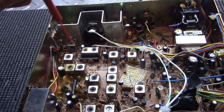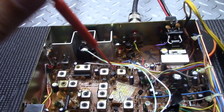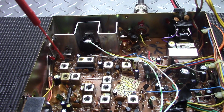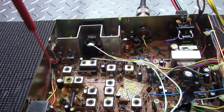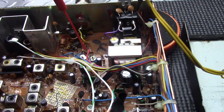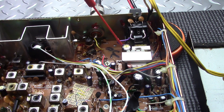Same thing with these — here's your tuning circuit for your RF, that gets retuned. If you have some equipment you may see better results. You're going to want to use at least something that has a true peak reading if you're just tuning with a watt meter, and then you're going to want to come over here and set your modulation on the scope. Hopefully you have a scope.